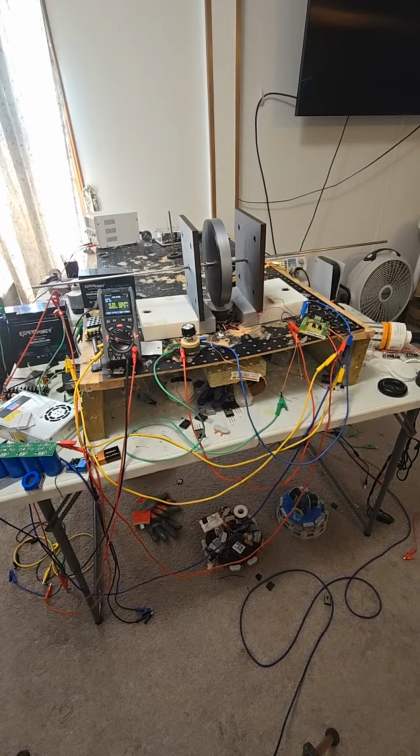But it only works when a magnet crosses in front of it. A reed switch is different. It works with the magnetic field, and that can lead your positioning to be quite erratic. And if I would go one or the other, I would go Hall effect sensor. And I would always have a transistor there, whether you need it, quote unquote, or not.